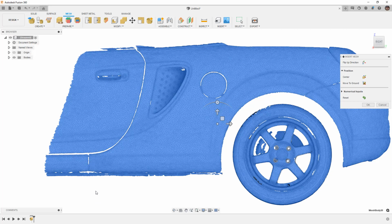So if you have like an old car from the 60s, I was restoring an old Camaro, and the A-pillars actually had lead where the A-pillar got welded to the roof. So if you're trying to restore something or work on something back that old, then it gets pretty tricky because you have to get rid of that stuff, either heat it up or grind it out, and it's nasty to work with.